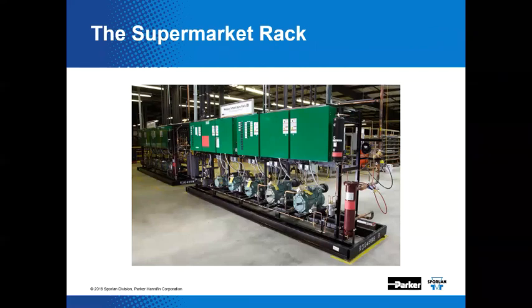That's for sure. Some installations have multiple and distributed racks throughout a store, you know, a supermarket. Other designs include one or more compressor racks in a mechanical room with split suctions intended to handle both low and medium temp refrigerated cases. And these systems may include different refrigerants. And boy, isn't that a case in point, because sometimes they have different refrigerants that they didn't even want, because every time a service contractor comes out there, they might put a different refrigerant on top of the one that's already there. And then condenser types and compressors can be unloaded and loaded.